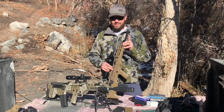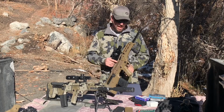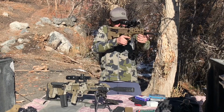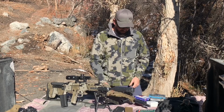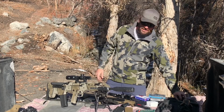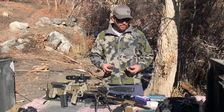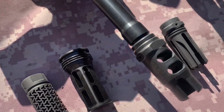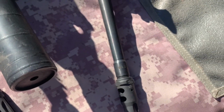The ratchet is designed to reduce recoil and maintain muzzle neutrality, so as the rifle recoils, it stays on target instead of dancing all over or rising, as you may find with a lot of different muzzle devices, or a lack of them. There's all kinds of different muzzle devices you can add to your rifle for different purposes, whether that is to mount a suppressor or just reduce recoil or reduce flash. There's all kinds of different things you can add to it.